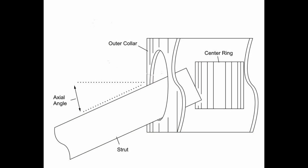The locking action in the outer collar is based on a ratio between the strut diameter and the holes in the outer collar. The size of the hole in the outer collar determines how far the strut moves before it locks inside the collar. As the strut moves against the hole in the outer collar, the fulcrum upon which the strut rests is moved away from where it is attached to the center ring hub and onto the locking collar itself. This puts any leverage produced by the strut on the outer collar and not on the hub, which makes it nearly impossible for the strut to shear away from the center ring hub under stress.